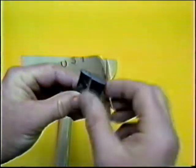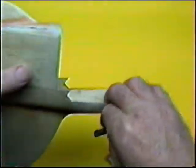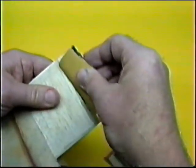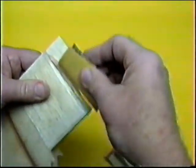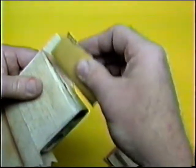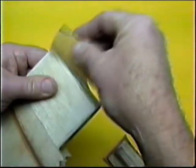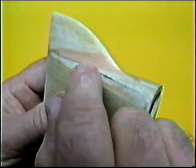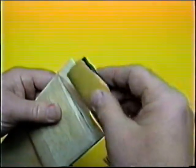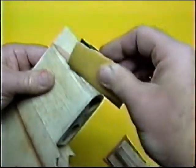I also have all my little rubber pieces, and I don't know how you could do some of these shapes and sizes. For instance, right in here, if you tend to do this, you tend to make ditches right at the end. The trick is just to kind of tough it out, because this really does take a little longer than the other way. But once you see there's a little spot right there that's low, well, I can just sand around it until I see I'm flat on all the surfaces.